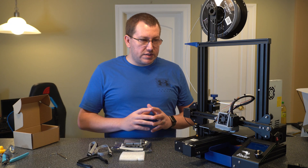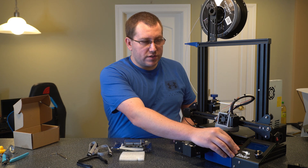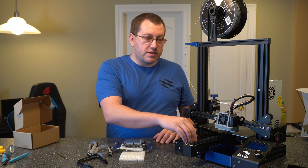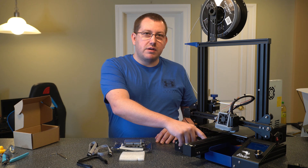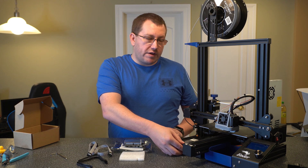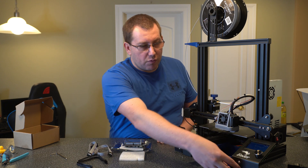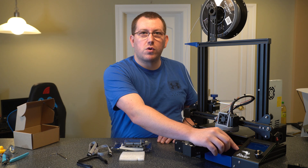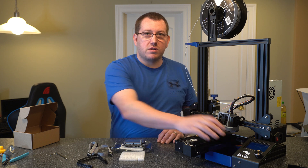So the first thing we're going to want to do is take this panel off so we can get this screen out and see what we're working with. Then we're going to want to get to the main board, so we're going to take this cover off. If you haven't done this already, you've got a screw on the top and then three screws on the bottom if you have an Ender 3 Pro, or if you have an Ender 3, you've just got three screws on the top. Then over here we just have the two screws, and then once we get this off we're going to have four screws holding the standard display on this frame. So we're going to want to take all that apart.